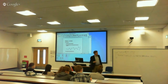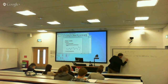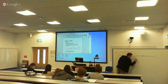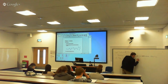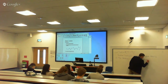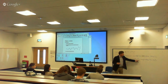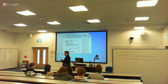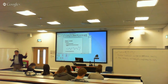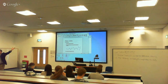The second stage of heat treatment is called age hardening. This is just a name, which is heating, depending on the alloy, at a temperature between about 90 degrees to about 150 degrees, depending on the alloy. And this is the key process. That is what makes them hard and strong. Okay, these are the two heat treatments. All aluminium alloys, if they are heat treatable, undergo that. Remember, okay. And these are the ones that give you very strong aluminium alloys, the ones that they use in aircraft structures and so on.